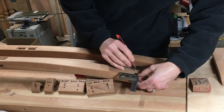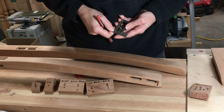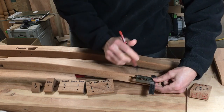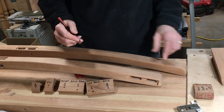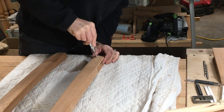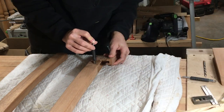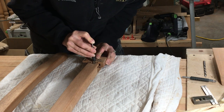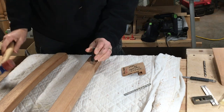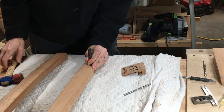It'll go much faster when I can do several of these at one time. The center of the quarter inch hole is marked, and the top one is 3/4 of an inch in. I'll set my gauge at 3/4. I'll probably just have a couple of these set up so I can go through them without having to reset everything. I line up my punch with where I designated the center — that'll keep my bit from wandering. I line up my bit in the hole that I punched, and use my saddle square to ensure it's square with my leg. I give it four taps. I'm aiming for this bit to go in perpendicular to this angled surface, so it's a little bit not perpendicular to what you're seeing here.